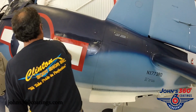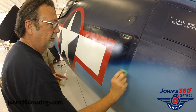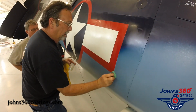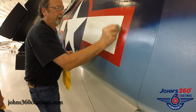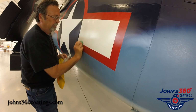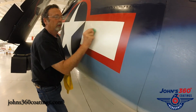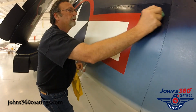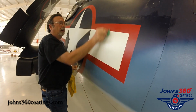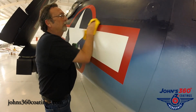This is actually a good way to demonstrate this coating, because over this dark finish you can actually see how far you get out of those little 8 or 10 drops. And you realize why we say don't treat it like wax. It's very concentrated. A nice thin even coat is all you want. We'll rub it on, we'll go back, and I usually go two ways with the application. I'll cross my directions up, make sure we got it all covered nice and even, and then we'll wipe it down.